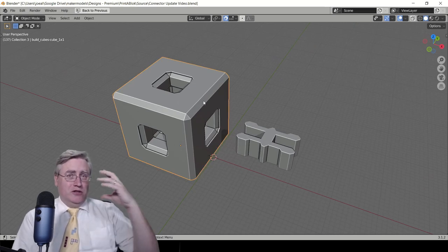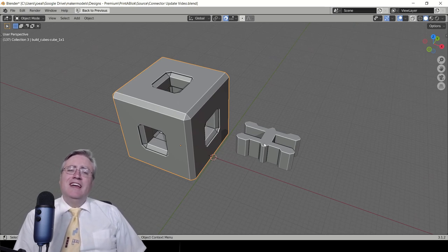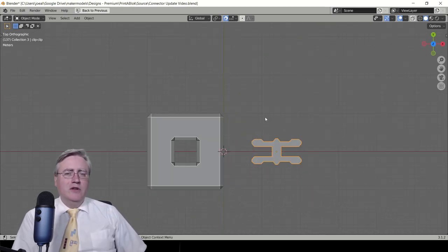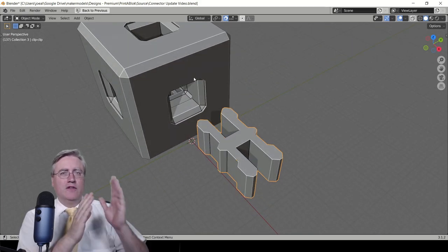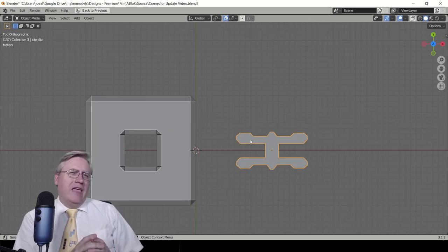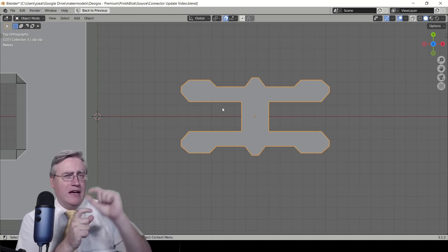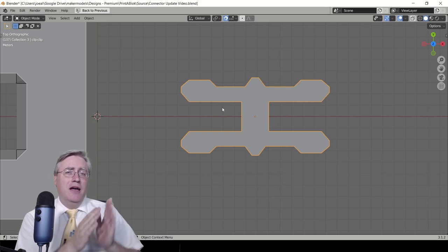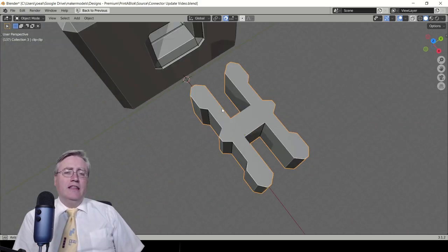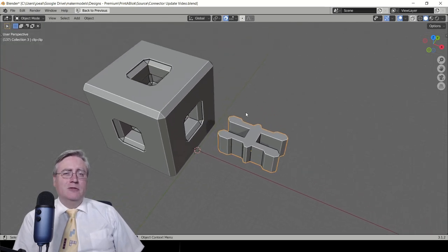This block is also slightly bigger — it's a 20-millimeter cube, because in 3D printing we love our 20-millimeter cubes. Now look at this connector. Not only is it bigger, and by having the holes be vertical he was able to make them bigger, but it's also a lot more H-like, a lot straighter. This has the advantage of flexing along the entire length, not just flexing in one tiny little part like the PrinterBlocks connector did. I got to thinking, well, why can't I just do that? So I did.